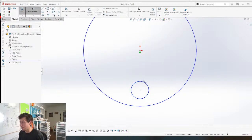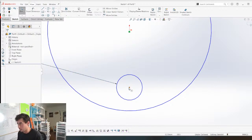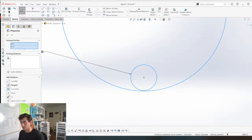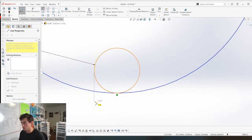So these ball bearings that I'm using are 12.65. So we're gonna make these holes maybe like 13.5. And I think I'm going to just touch that to the edge, tangentialize that, and we can bring these arms down, boom, that's one, that's two.